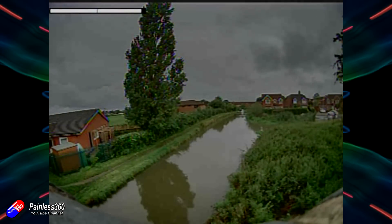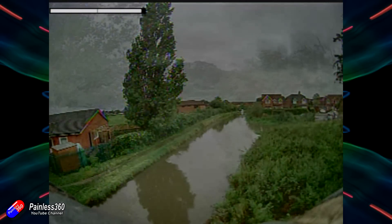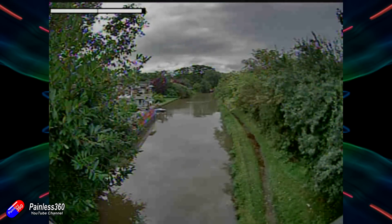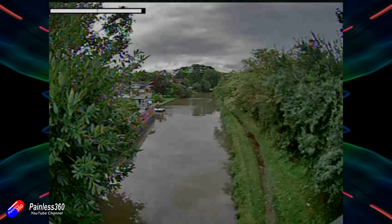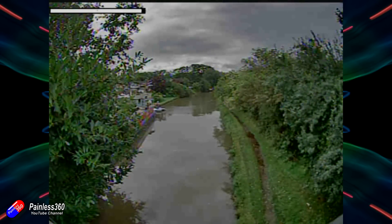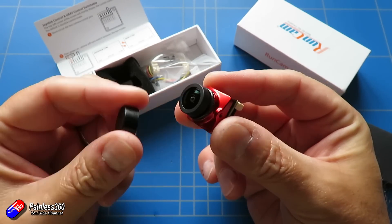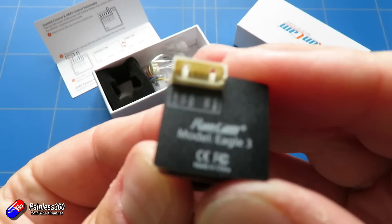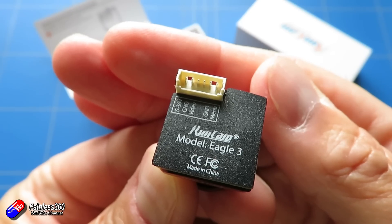The performance is very very good - the light handling, the colour reproduction, all that stuff is fantastic. The only downside for me is that it's NTSC only and I wish Runcam had added the PAL option. NTSC is fine for the Americas, but lots of us in Europe run PAL, which actually gives you an extra few lines at the bottom of your screen when running your on-screen display, so your OSD can be a little more laid out when flying FPV. Hopefully this will return in future versions, but the testing I've done shows it works exactly the same as the other Eagles - slightly smaller, slightly newer, with exactly the performance you'd expect.